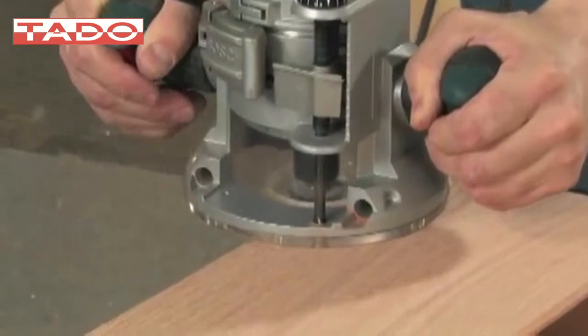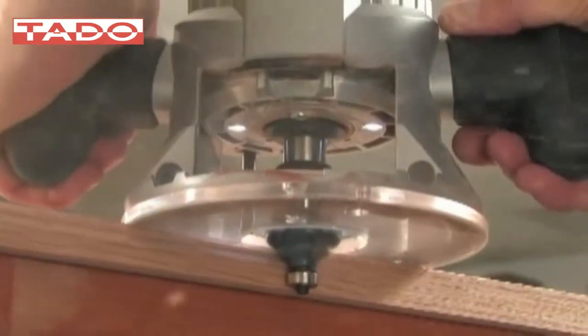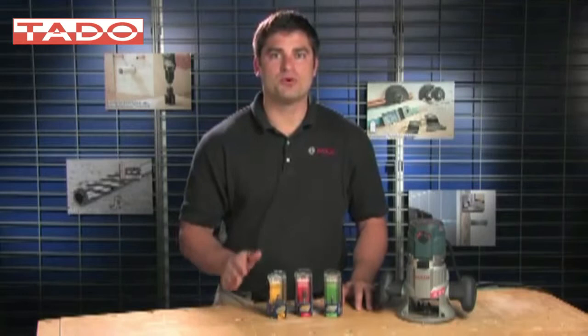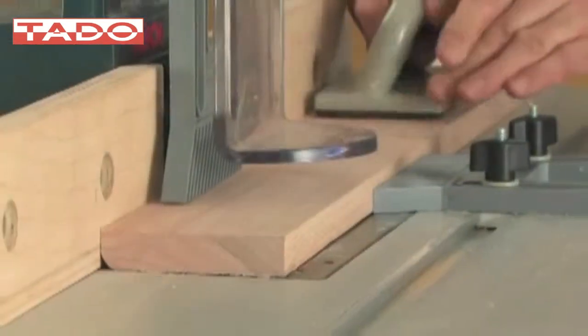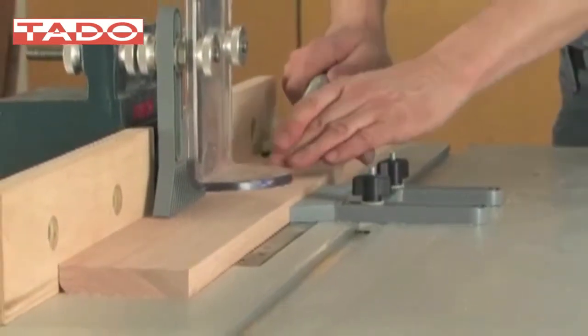If you're putting up a shelf or any other woodwork, adding an edge on it distinguishes your work. Here's a quick tip: there are two ways to approach a cut — a climb cut or a push cut. You want to avoid the climb cut, which is a cut where the bit wants to grab the material and run. Do this by feeding the material in a direction that's opposite the way the bit is spinning. That's a push cut.